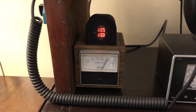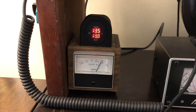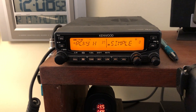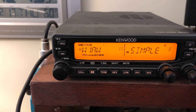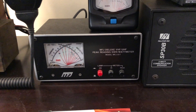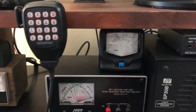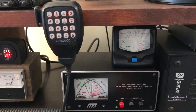Down below — you've seen this before if you saw my shack tour — this is a homebrew little project, an AC voltmeter, and above it I've got a pair of DC digital voltmeters that monitor two power supplies running the DC rigs in the shack. Below that we have a VHF UHF MFJ meter. I got this at a ham fest years ago and the output of this rig goes through that so I can keep an eye on SWR and how the antenna is performing. This meter is used exclusively for the six meter squalo antenna, which is not up at this point yet — it's here but I just haven't gotten up on the roof, and today with a foot of snow I'm not doing anything.